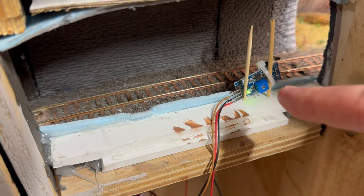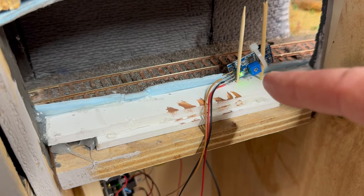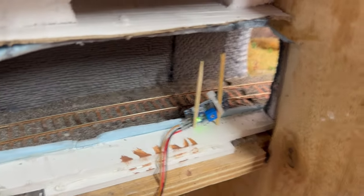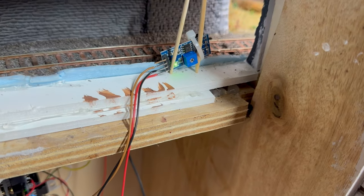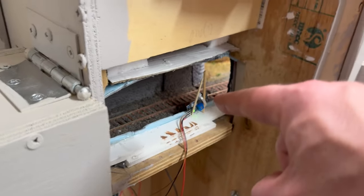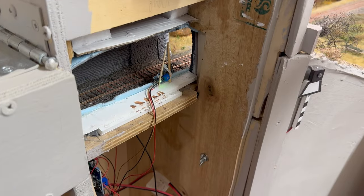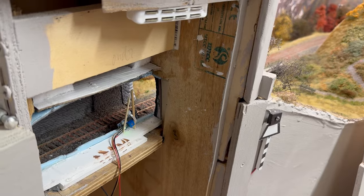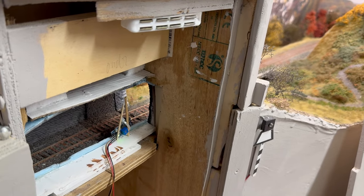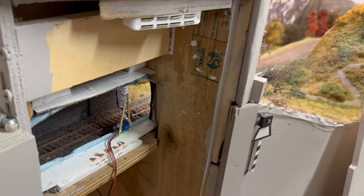The other contact is hidden away in the tunnel. I'm going to replace them with something better, but it will still work. So if I make a contact here, nothing happens, because that's the train that's still driving in this direction — that first has to pass this contact. And then the installation waits about five seconds before it arms again, so it's ready to switch on again. That's just to give a little bit of pause — not to react too soon to a train driving in the wrong direction. So if I activate it now, you might have heard a small click, and it's active. When the train passes this contact, it's obviously driving in that direction, so we have to wait five seconds or so to switch it off — that's enough time for the train to pass.